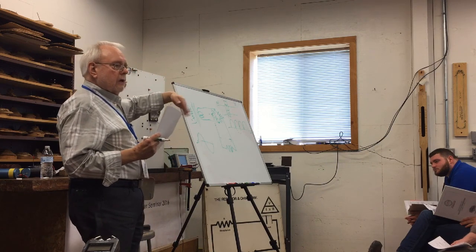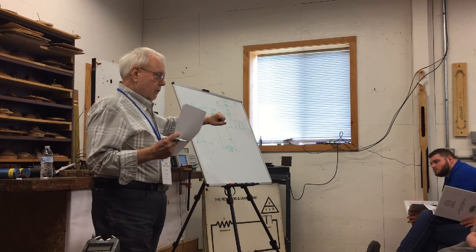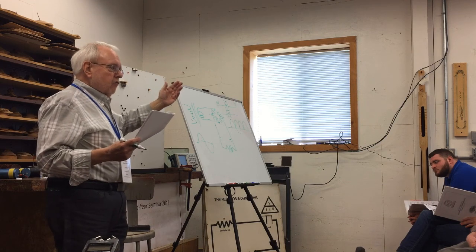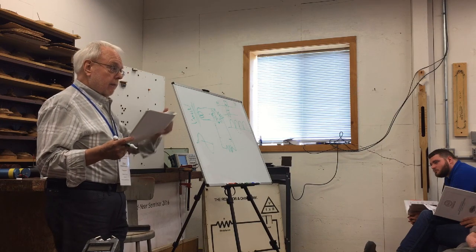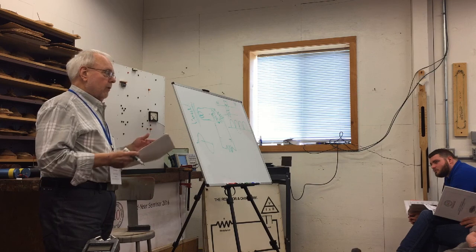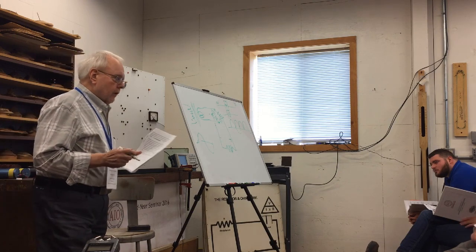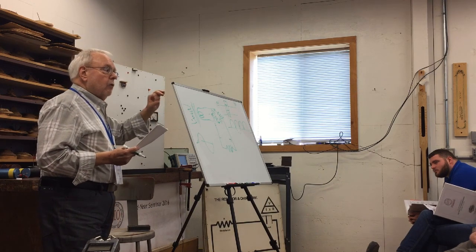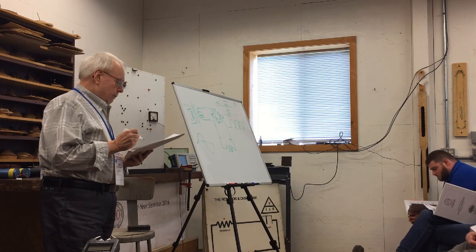So if you think of the diode as a little one-way flap valve, say a piece of leather in a nice plexiglass box covering a hole with the tube going in one end and out the other. You blow into the tube that shuts the leather flap, and eventually you're going to be able to blow hard enough that the leather will sort of get sucked into the hole and air will flow the wrong way. So that would be the breakdown voltage of the diode. How many volts, how much pressure can it withstand? Blowing the other way, the flap opens, and the current carrying capacity of the diode in amps or milliamps, thousandths of an amp, will be determined by how large that hole is and how big the tubing is and the capacity of your lungs. I think we'll break right here, if we may.